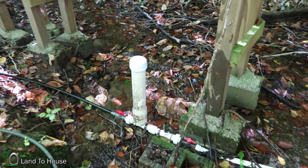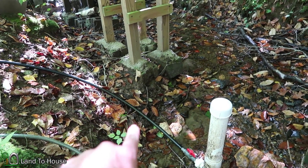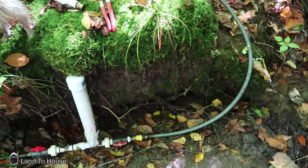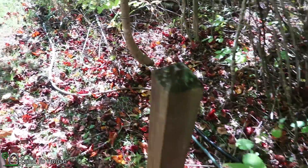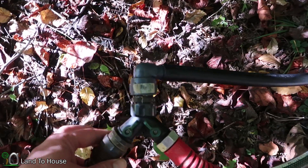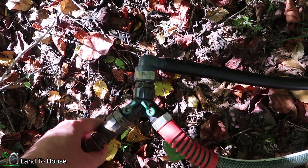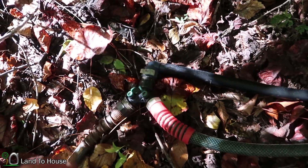The two pumps I'm going to be using today are a 1-inch ram pump with 3/4-inch poly pipe delivery pipe, and a half-inch ram pump with a garden hose delivery pipe. These two delivery pipes travel 100 feet before connecting together with a Y, and from there they go on uphill a few more hundred feet.